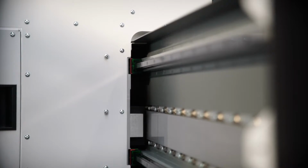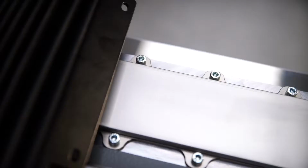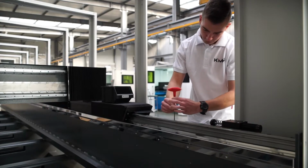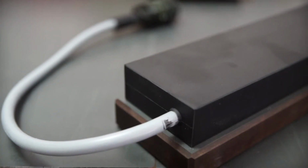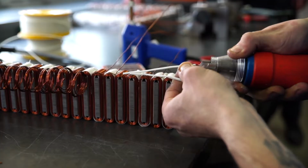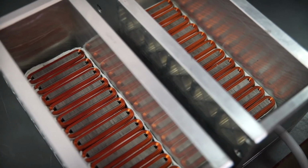Linear motors, however, are relatively heavy, resulting in reduced acceleration. That is why KIMLA researched the use of modern magnetic materials with high saturation induction for use in new generation drives. As a result, linear drives were created and implemented for production, in which the power was increased 3 times without increasing the weight of the drive.